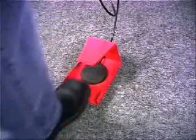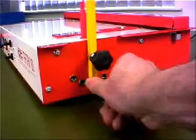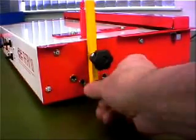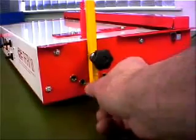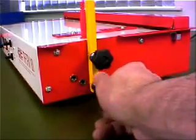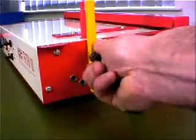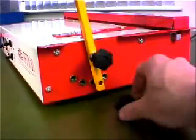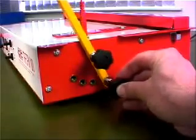Take your foot off the footswitch when you've finished cutting. To alter the angle of the cutting wire, remove the lower bolt at the foot of the wire bow and slacken the upper one. Tilt the bow to one of the four preset angles and replace the bolt.